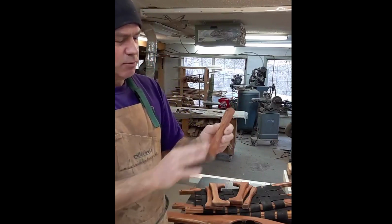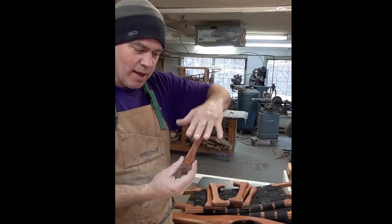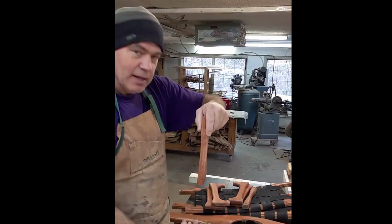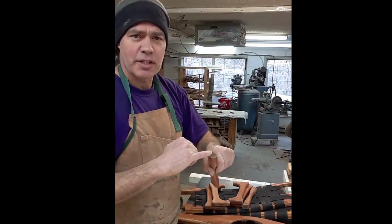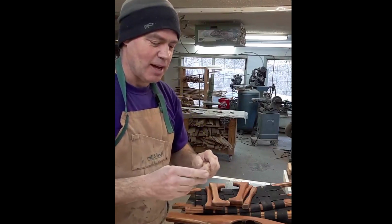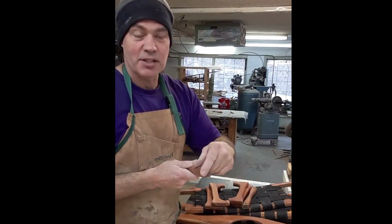If you think about a piece of wood, the grain is running across this way. It's kind of like a whole bunch of straws all running that way, and when they get dipped into the oil, it gets sucked right up into that end grain. And those are the areas that start to rot out first because they don't get sealed properly. Often when canoe builders put a boat together, the parts are over length, they cut them, install them, and there's no protection on those ends.